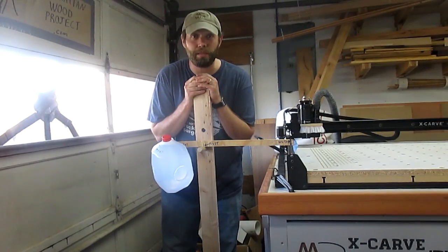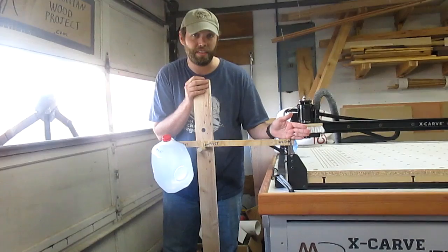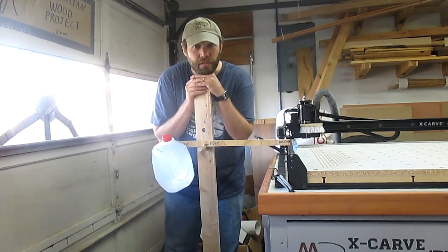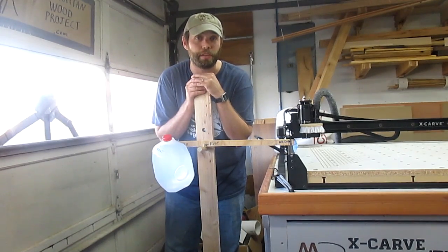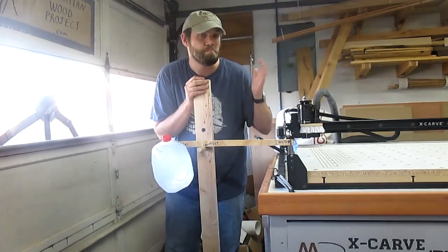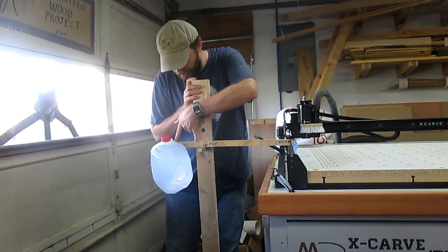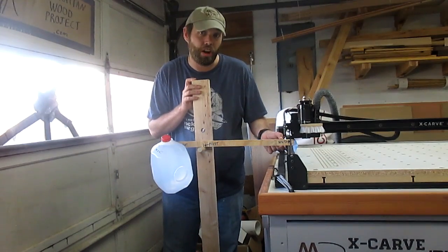To sum this up: I like having about three and a half pounds of tension on the belt for now. That might change if I start experiencing tight or loose belt problems. Anything higher — I used to have my belt at five to six pounds — and I snapped three belts over the matter of a few weeks. Still trying to dial it in, but right now three and a half pounds to lift the belt one inch is all I need. So: a gallon of water, a one-to-two-and-a-half ratio, and a one-inch tall piece of plywood.